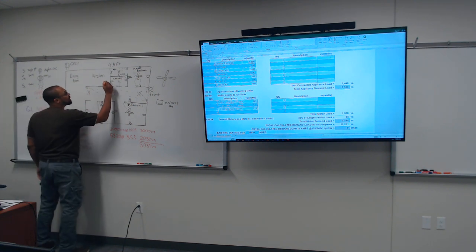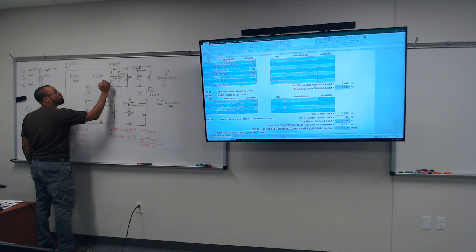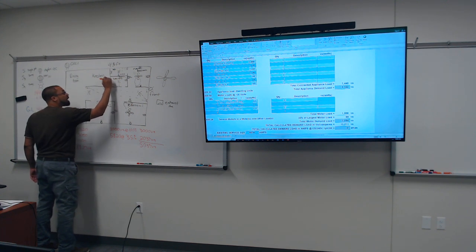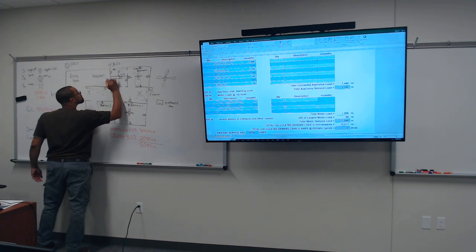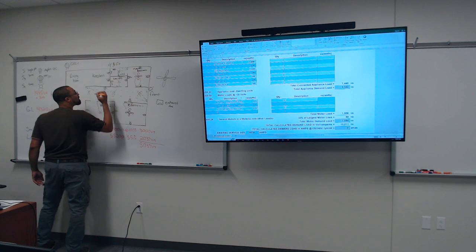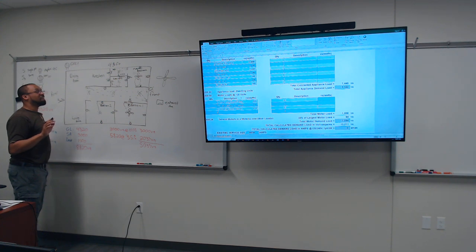All right, but these plugs right here, let's say this right here, this is gonna be the countertop. I'm not drawing countertop, kitchenette stuff. We're gonna put a GFCI here. Okay, we're gonna put the word GFCI. All right, and then we'll put another plug that's protected on the GFCI. We need to drop a plug that goes to a single pole switch. That goes for your garbage disposal.